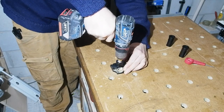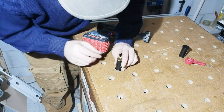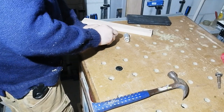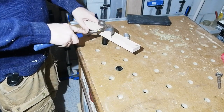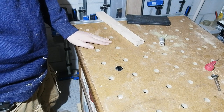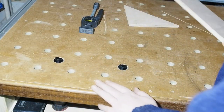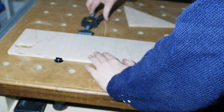The collar on the Ganway dogs is 30mm in diameter and about one and a half to two millimetres deep. I do the recess first, checking the depth for flush with the dog upside down. Happy with that, I can drill the through-hole for the main body - this is 26mm. I don't have a single drill bit at 26mm, so I used a 25mm and sanded the inside of the hole a bit until the dog could be persuaded through. The good thing about this is it gave me a nice tight fit. Not my neatest work - perhaps making a router template would be a better idea for cleaner holes - but these are perfectly functional for my needs.